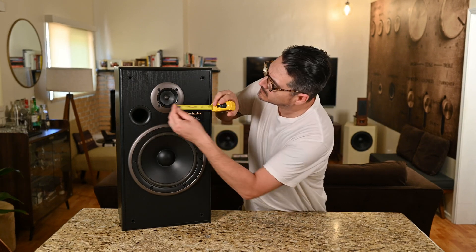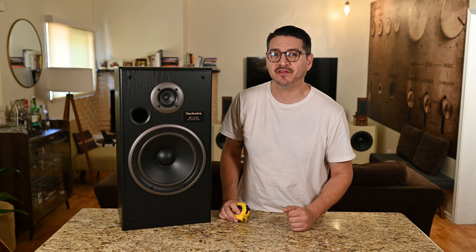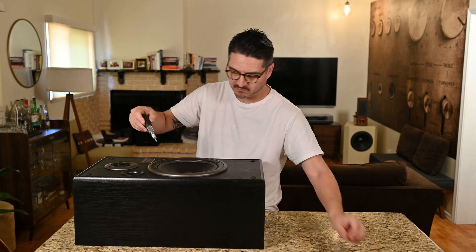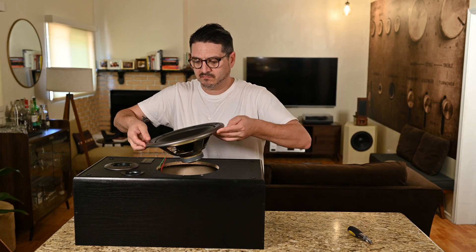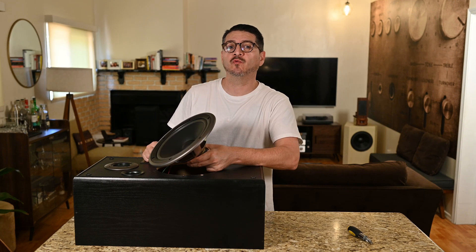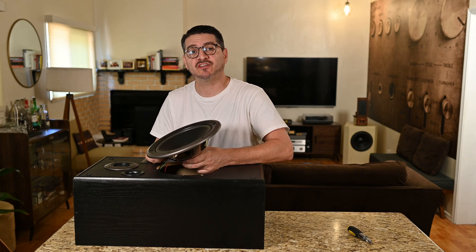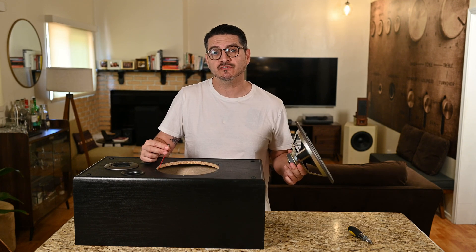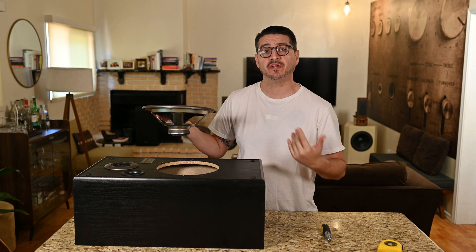Let's get these unmounted. Note that red and green wires are coming to the woofers — the positive is red, the negative is green. The positive has the larger of the two spades. It's a fairly light magnet, but in this box you actually get a pretty full sound.